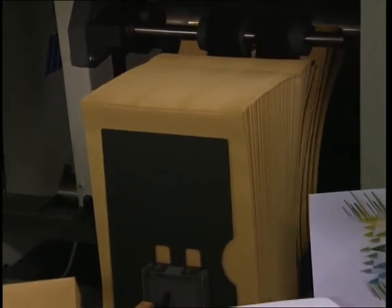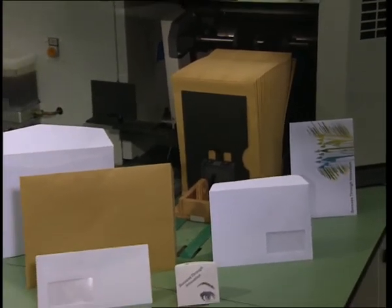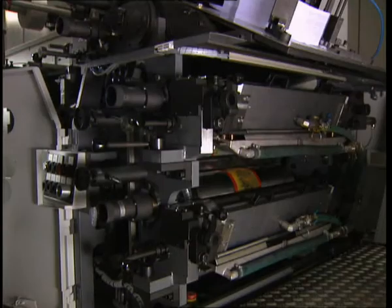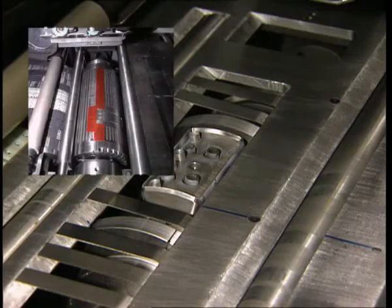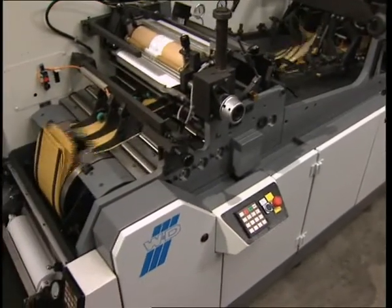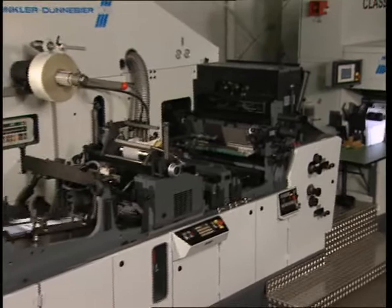The Classic has also been designed for established envelope and pocket manufacturers, to complement high-performance machines, and no envelope factory should be without one. With its multifunctional feed table, two doctor blade flexographic outer print units, and an inside print unit, as well as a window cutting and patching section for one or multiple windows, and a side flap folding section, the Classic is well equipped. The subsequent sections are manufactured in well-proven W&D quality. The Classic is characterised by its extremely wide variety of sizes.